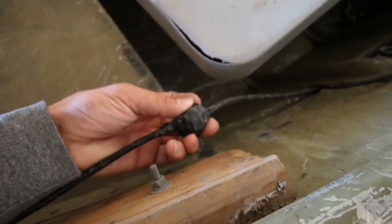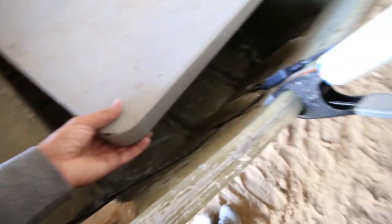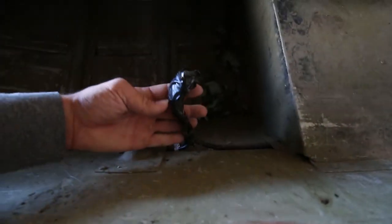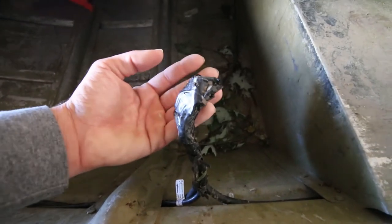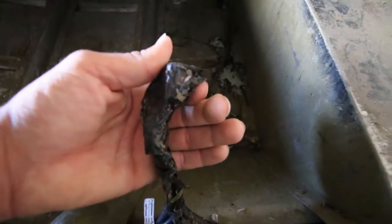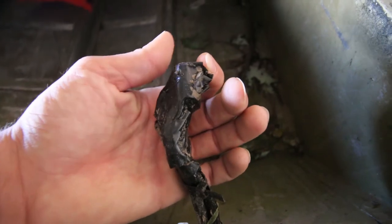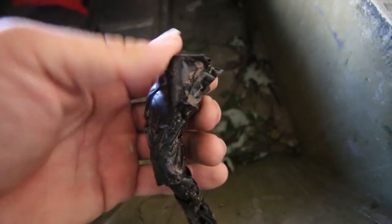So I connected those wires, ground to ground, live to live, neutral to neutral. I put it through the sidewall just for getting it out of the way, not crimping anything accidentally. And the second section, with this I've got 3 ground wires, 3 live wires, and 3 neutral wires, and they're all capped off together. You do ground to ground, neutral to neutral, live to live. And I used wire nuts on this part here, so there's 3 wires coming together in each wire nut.